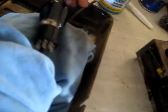Okay, viewers, that's the second stage IF tube. Came up alright. Some of the stuff's a bit hard to get off. I gave it a good polish with a wire brush, and this steel wool very carefully, because that's the grid connector. You can see that goes down into the middle of the tube, called a grid cap. There we go, only goes one way.